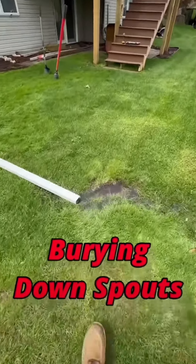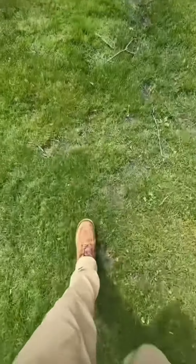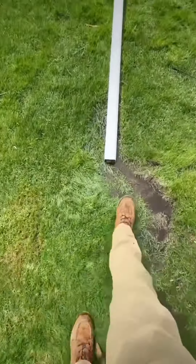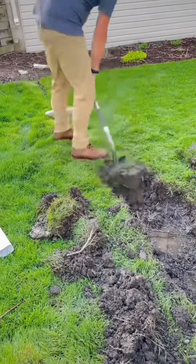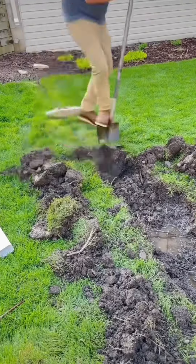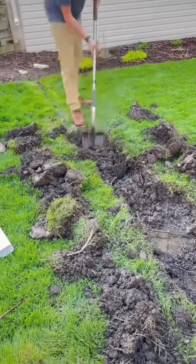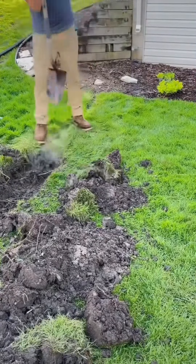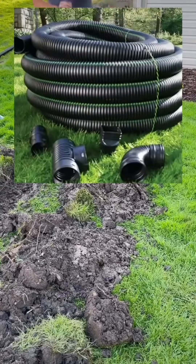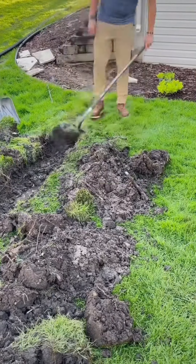I thought this was going to be an easy project. Then immediately after starting to dig the trench, it starts to fill with water — and that's less than ideal. So we're not just burying the downspout; we're also going to add a drainage tile because this yard is far too moist. Digging a 60-foot trench got to be kind of long, but as you can see, it's literally just mud. Moisture and basements is not a good combination, so before we run into issues with that, we got to run this drainage tile — a four-inch pipe that's going to suck all the water out of the soil and spit it out where I tell it to.